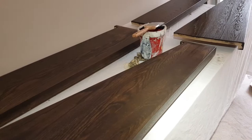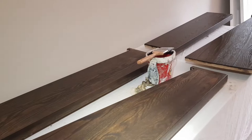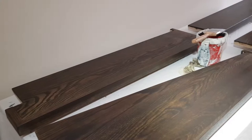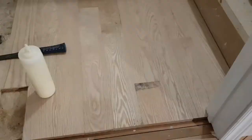Oh, that trick is pretty much mandatory if you do a double dark. So if you put a coat of sealer down, whether it be spray or sanding sealer, and then you stain again to get that double dark, you have no choice, because the stain won't soak into the wood. It'll be sitting on top of the sealer. So therefore, if you did a brush coat, you'd be just dragging that stain around with you. So you have to spray.